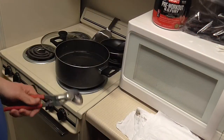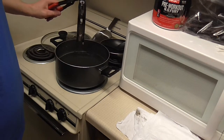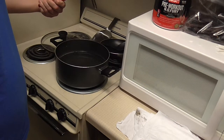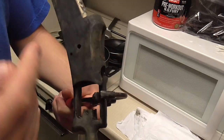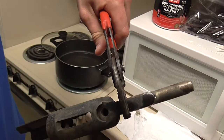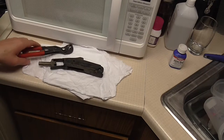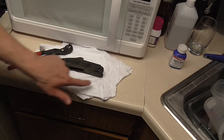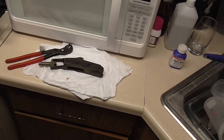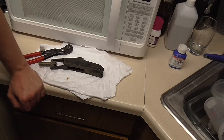I have steamed off enough of the water now — it's down about half an inch. I'm going to go ahead and grab this out of here. You can see there's a nice little coat of rust buildup — and obviously that's what bluing is: it's just a rust. I'm going to put this on the towels, let it cool off, then change the water out, and take and buff the crap out of this with steel wool and a wire wheel with a Dremel. We'll see what all it does — make sure it doesn't go back to the polished stainless look.